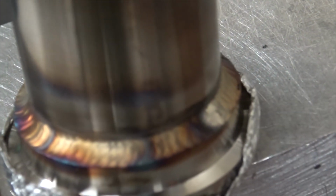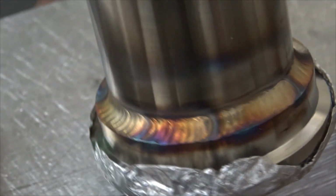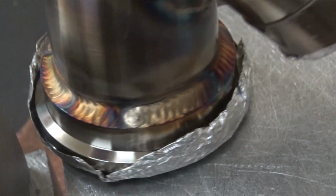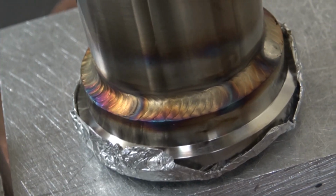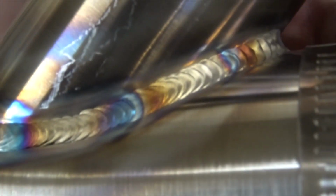And then this flange here, can we focus? No, we're not gonna focus. This flange here was just done with straight current. I did it at about, I think, 74 amps. I cheated and used my big old, no, that is a 20. I'm sorry. Yeah, I did the 20 with both of these. So yeah, big 20 cup and nice gas coverage, just straight DC right there, and then the pulses on that guy. And I'm pretty happy with the way, just really smooth controllable arc.